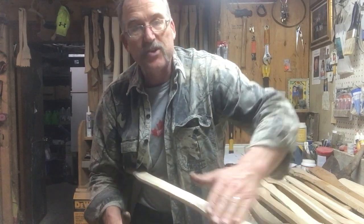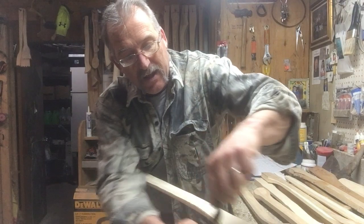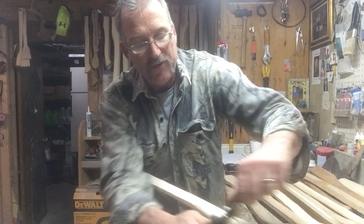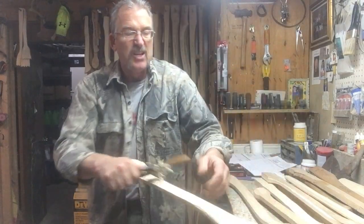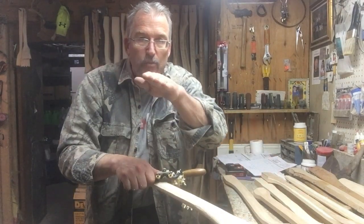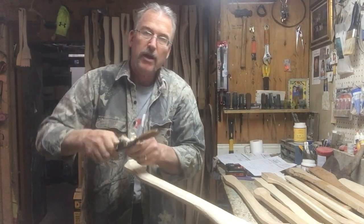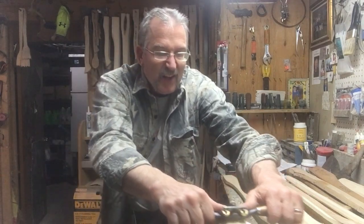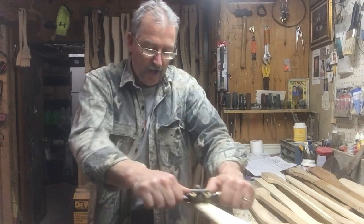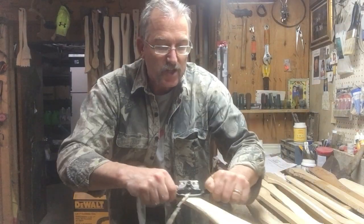I start up here where the handle takes a swing out - that's the neck, going into the eye of the axe. I just round that out. It's basically octagonal when it comes off my bandsaw, so I round that and take off the other edge. I'm going to make it slope down - sloped on this side and sloped on this side - to get that basic teardrop shape on the axe handle. When I'm coming along this way with my spokeshave and it chatters, I know I'm coming across grain, so I'll flip it around the other way to smooth it out.